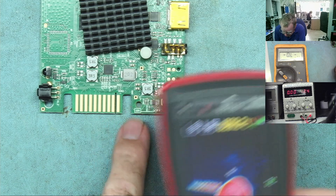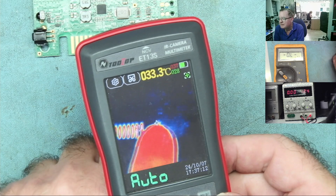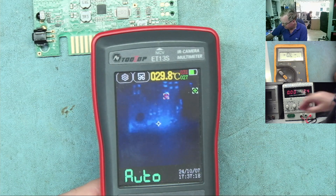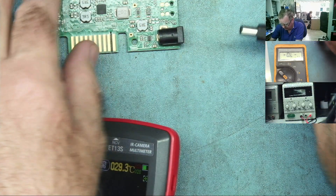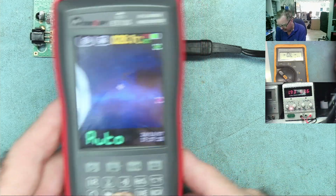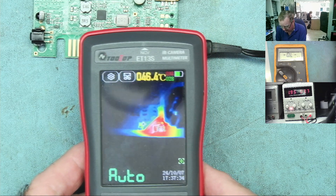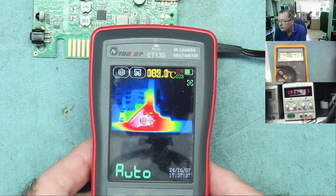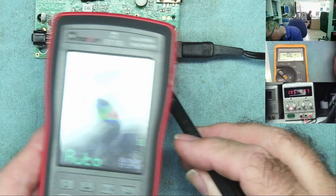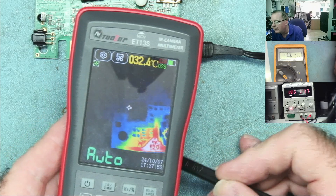I'll put my fingers — that's where the chip is here. I have my finger at the moment on the capacitor so you guys can see. We're in this area. Let's find out — I'll connect the power, switch the power supply on and see what happens. We have 2 amps, and something's hot in this corner here. Can you see it? It's right down on this edge somewhere, near the power connector. I think it's one of these capacitors here.